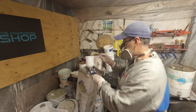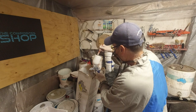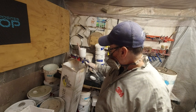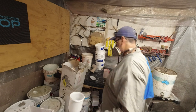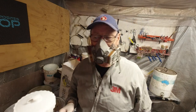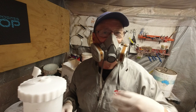While you're there, get your brush and start cleaning carefully. After about three or four flushes with that brush in place, we still haven't dismantled the gun, but you can feel that the cleanliness is paramount. That's just pure acetone now. What I'll do to store the gun is simply leave some clean acetone in it, get the lid on, and just leave it in its stand. The only problem is that it will allow evaporation, so it's a good idea to tape up or block that breather hole. Storing it with a bit of acetone in it will always keep it nice and clean and ready for use next time.